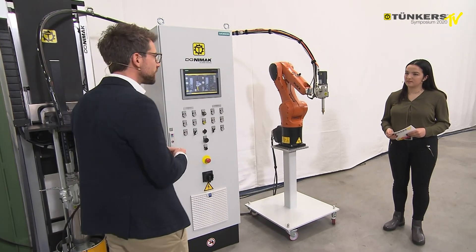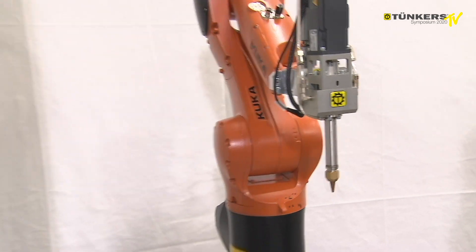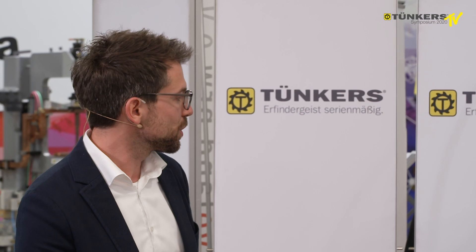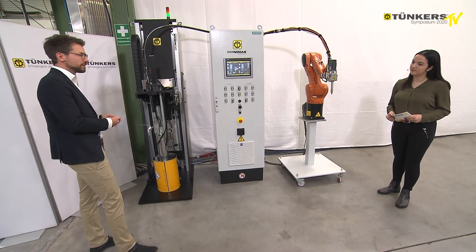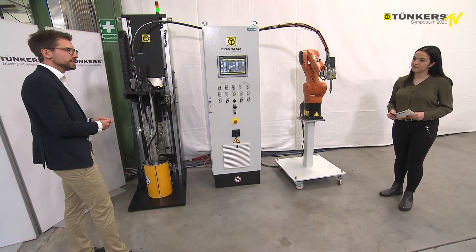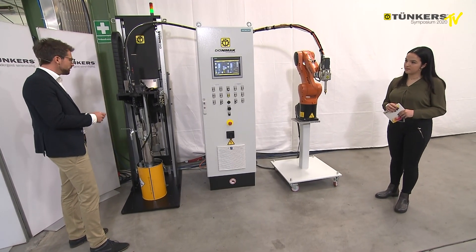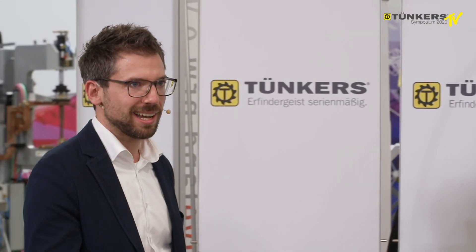And another point is that this application head of the Smart Dosing system could also be used with a conventional dosing system. Are there any other special features? Yes, another special feature is the pump station. The conventional variants always consist of a pneumatically driven pump station, where on the right and left you would have two cylinders for the stroke for the lifting movement and in the middle a cylinder for the pumping as such. We have completely changed this. We have designed a new product which is only electrically operated, and with this electrical pump station we can really keep the process so stable that we can apply the seams according to the customer's requirements without a dosing unit.